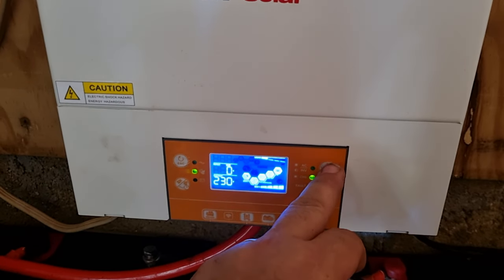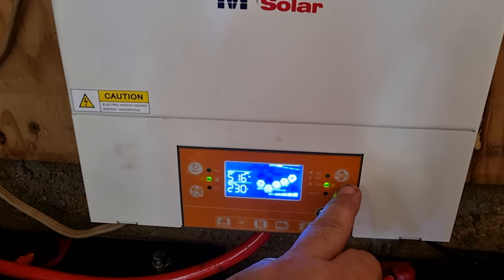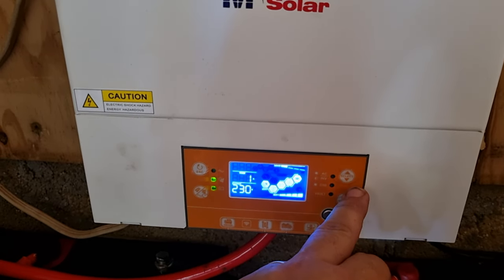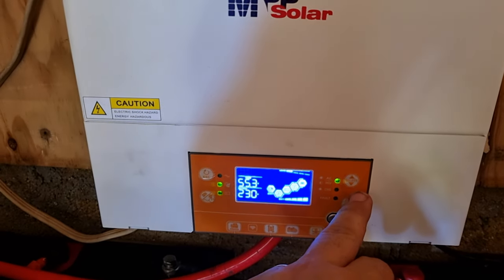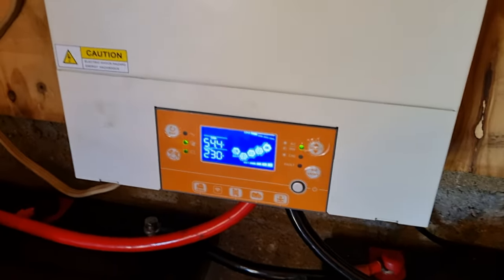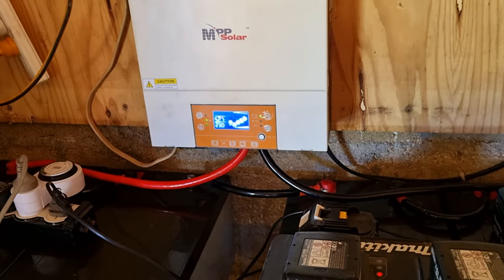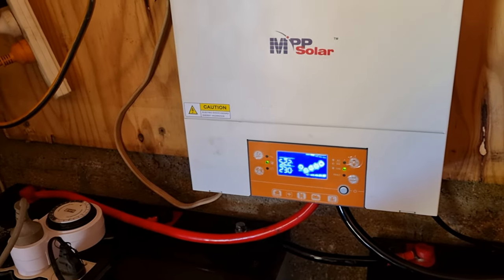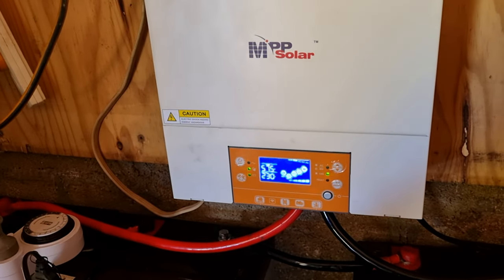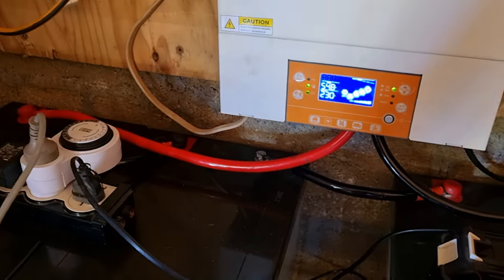What have I got in there? 300, 516 watts coming in, 700. Then 55 on my battery, 54. So this power there, it says it's full, but at night time — well, the last week — as soon as the sun goes down, it's dead. One of the batteries is dead at 10.5, and all the rest is okay.